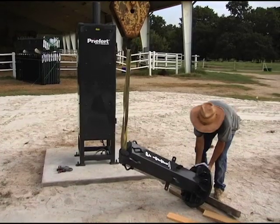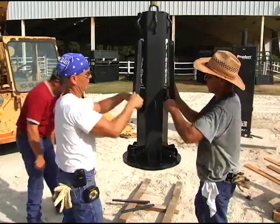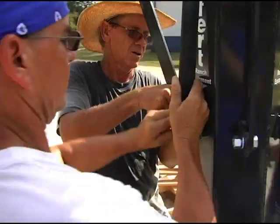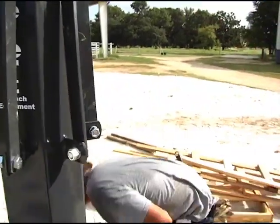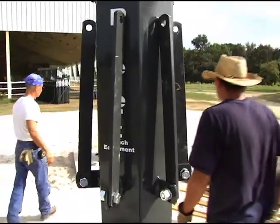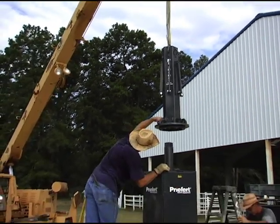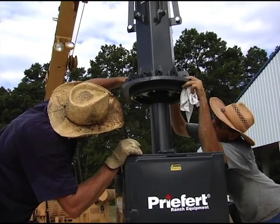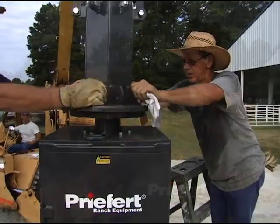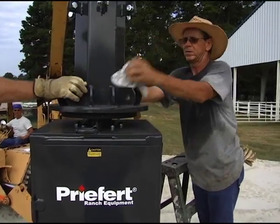Now you can attach the tree. Before attaching the tree, you will want to hand tighten all support straps, bolts, nuts, and lock washers to the tree. Turn support straps up against the tree — you will return later to securely tighten all the bolts. Use a chain or strap to lift the tree from the lifting eye located on the top of the tree. Lift the tree above the base and slide the tree over the main shaft. When the tree is all the way down, turn the tree to make sure it slides down and locks into place on the main shaft.